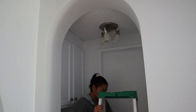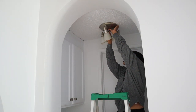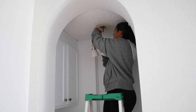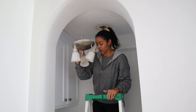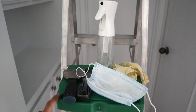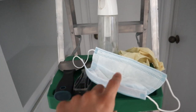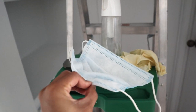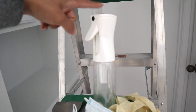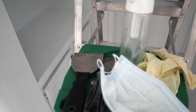The first thing I'm going to do is remove the light fixture, because it needs to be removed before we can start the process. I was actually able to get it off quite easily — it came off all in one piece. I'm using my ladder, which has a little ledge where I store all my tools for this project. To scrape the popcorn off the ceiling, definitely make sure you have a mask to wear because you do not want to inhale any of the popcorn. I'm using a set of gloves and a spray bottle with a really strong mist.